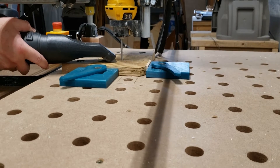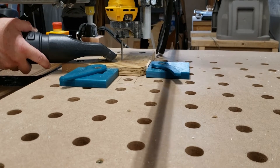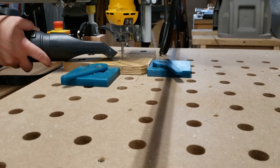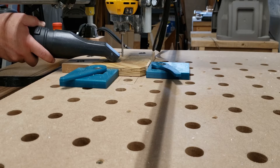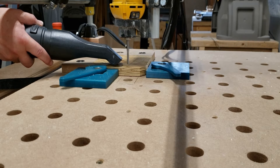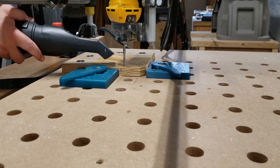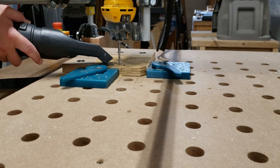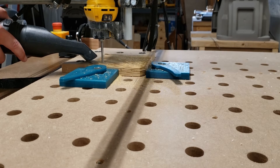On to cutting the parts out — to be honest, this is much quicker than 3D printing. If I 3D printed this part it would probably take four and a half hours; this is taking about nine minutes to cut. I'm using a very conservative feed rate because you can move things around and break pieces off. This is plywood, and as it cuts down lower it will break pieces off — you can actually see that happen even with a slow feed. If you go in too fast you will cause it to snap pieces off, so I like to do it nice and steady, keep the vacuum close by, clear up the sawdust as it's made.